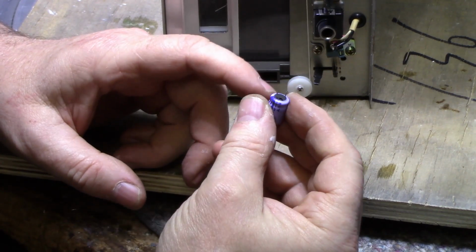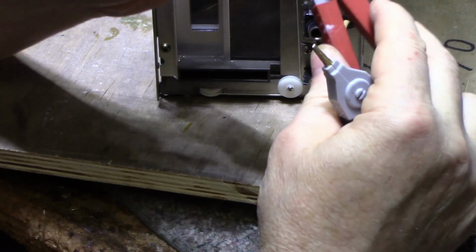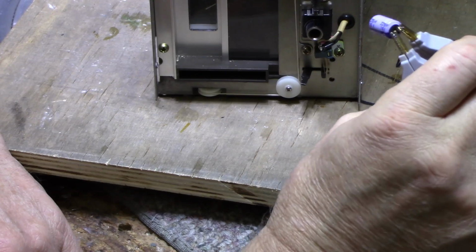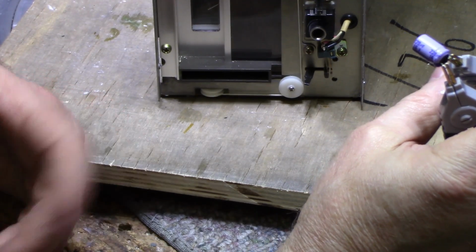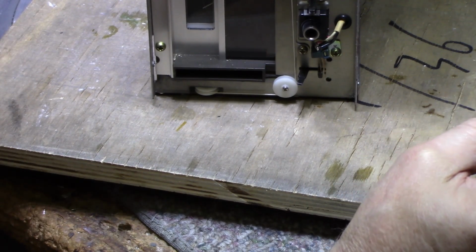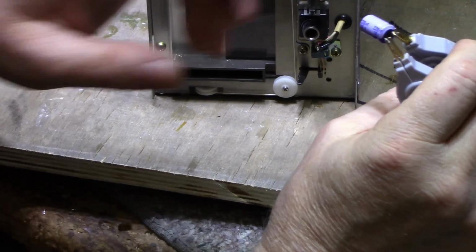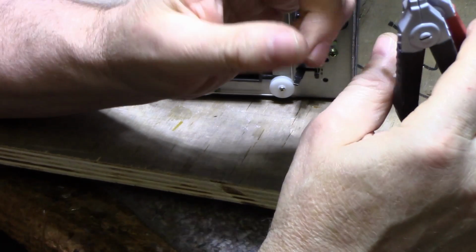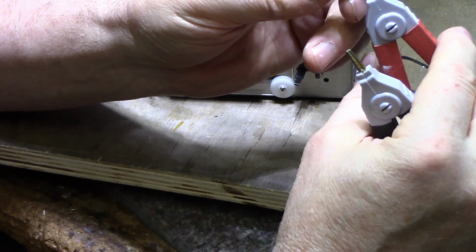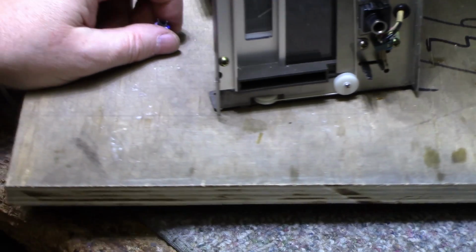This is one of these situations where these are probably perfectly fine capacitors. If I measure this, this is a 220 at 16 volts, and it's measuring 224 microfarads, which is bang on, and 395 milliohms, which is actually a little touch high. It should be around 330 milliohms as a max, so it's a little bit beyond that limit. But this cap is still working, and I have to replace them all because they're leaking. So I guess I'll get my caps out and start plucking away.